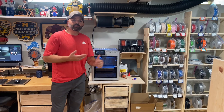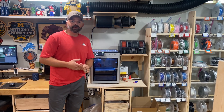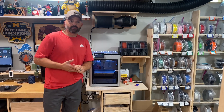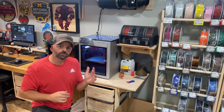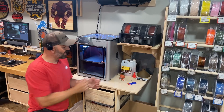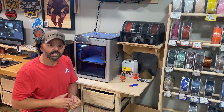Just like everything else, 3D printing has a learning curve. Something I learned over the eight months of running my X1C is that while printing PLA and more specifically PLA silk, I get much better results if I vent my chamber. This is a fully enclosed 3D printer, so I want to let that heat escape just a little bit — I can either open the door or prop open this lid.